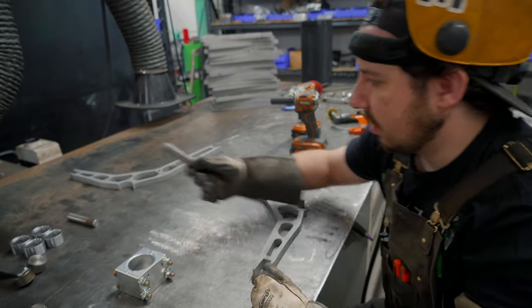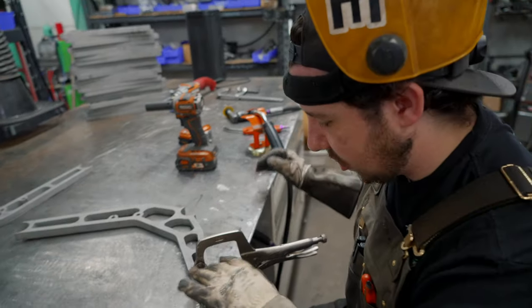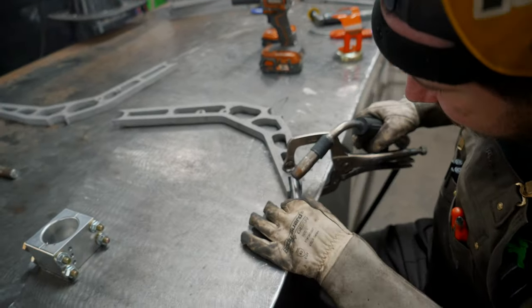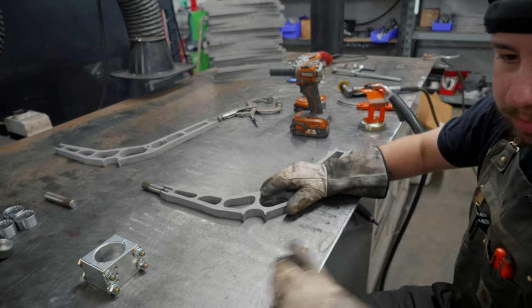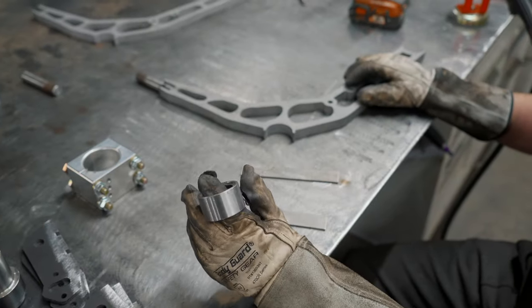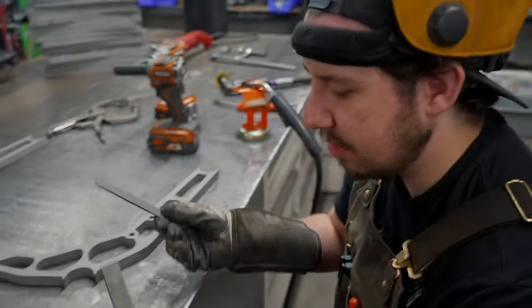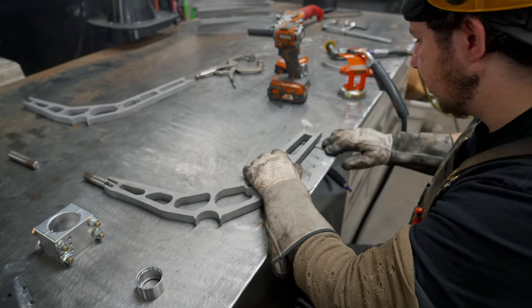It's going to get a stud on the end — a three-quarter stud welding to the three-quarter plate. No spacing on this one; we'll just tack it flat to the table and space up our bearing cups. We have a quarter-inch difference, split between the two halves top and bottom we get an eighth, which is roughly what these are — 11-gauge stainless. We'll space up the arm.